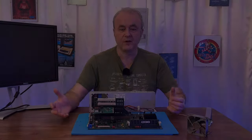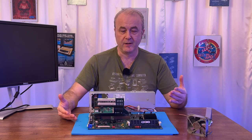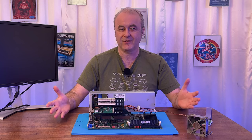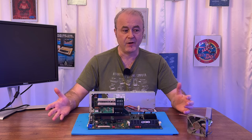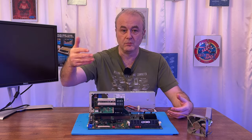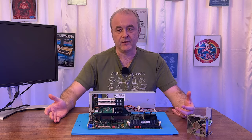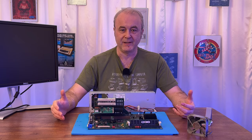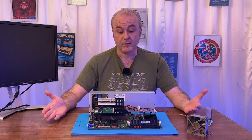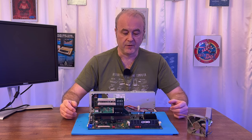So what I can conclude from that is that if you're going to measure any clock speeds over the rated level of an oscilloscope, you're going to get possibly weird results. And that's kind of expected, but honestly, I'd never owned an oscilloscope until recently, so I didn't know if that was a thing or not. Maybe it can only show the waveform for 25 megahertz, but it has more tolerance at actually recording it. It turns out it does have a little bit more tolerance, but really, once you get above the rated speed, you're going to go into uncharted territory, and you're probably going to get back unreliable results that you shouldn't really rely on, which I didn't. So yeah, that was that.